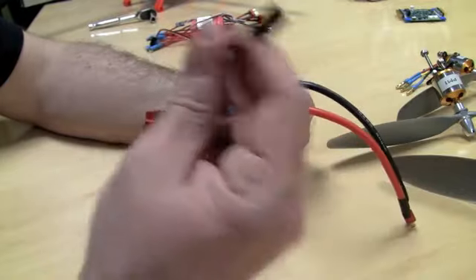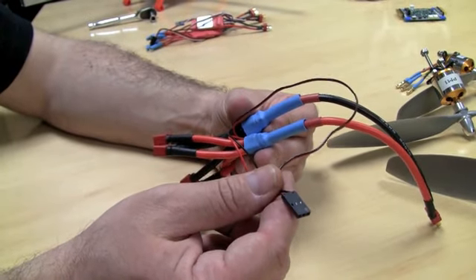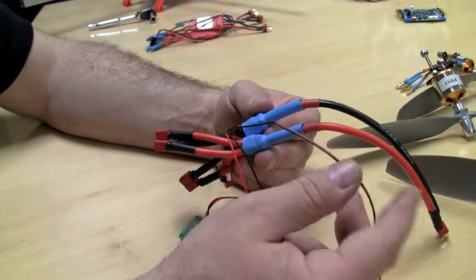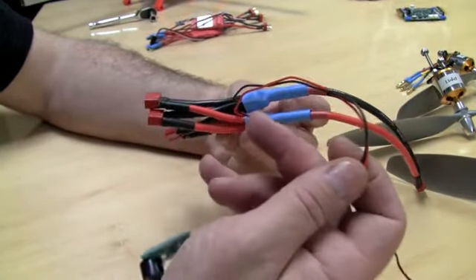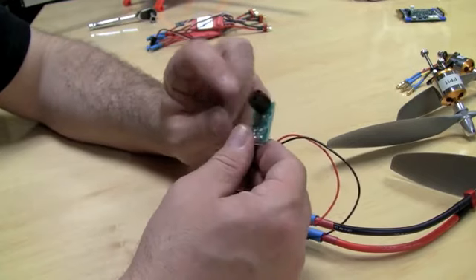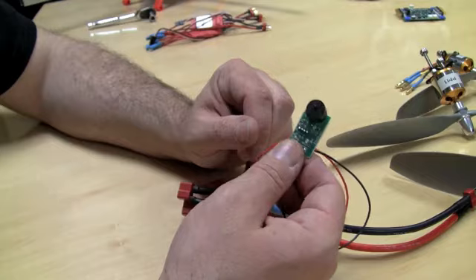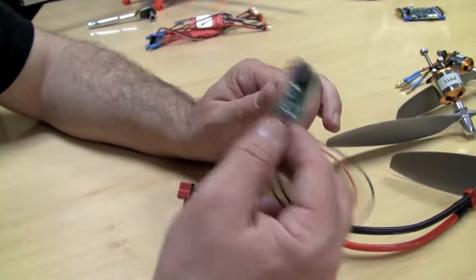Also attached to your wire harness, you'll need power for the Hoverfly Pro. It comes directly from your battery to the Hoverfly Pro as long as you have a 3S battery where the voltage doesn't exceed the 16-volt rating of the board. If you've got a 5S battery, you'll need either a separate battery or an external regulator. There's also a voltage alarm wired directly into the harness — specifically for a 3S battery. The LED blinks blue when you're good, then a buzzer sounds when voltage gets too low. It only costs a couple of dollars and will save your LiPo packs from being over-discharged.